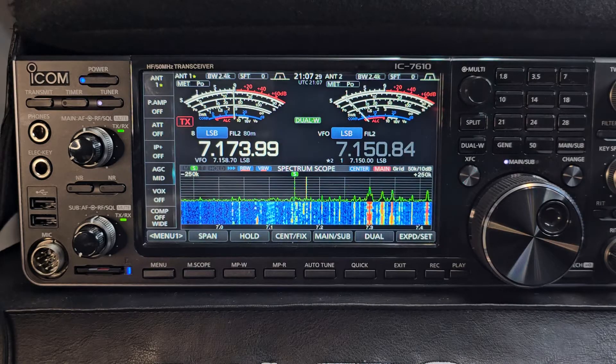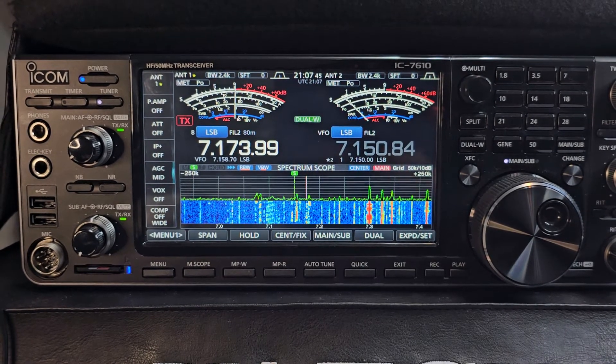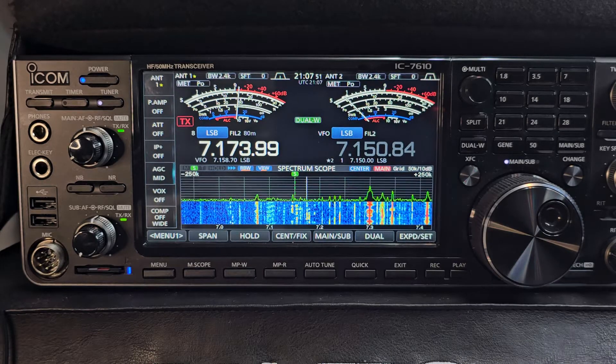So what is DPD? It comes with the newer firmware, versions 1.41 and 1.42. DPD stands for digital pre-distortion. Pretty much speaks for itself — when you amplify a signal, it can distort. The DPD function is going to reduce that as much as this radio can. The way ICOM terms it: it corrects signal distortion to the output signal.